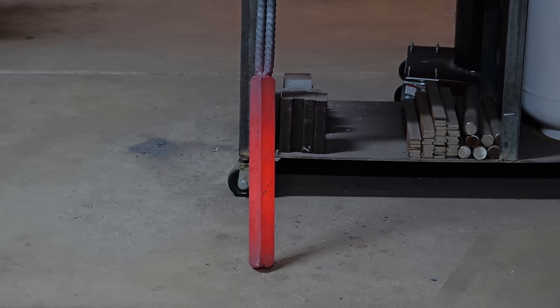Before the etch, I made sure to wash the entire blade with regular dish soap — I actually did this twice to ensure there was no oil left on the blade. My process for bringing out the Damascus pattern is the same as everybody else: I take off all the oxides with a high grit sandpaper, in my case 2500 grit, and then re-etch it — making sure to get all surfaces on the bolster as well. With everything polished up again, it's time to wash with more dish soap and then give it another two minutes in the ferric chloride. You can see a lot more contrast already, but this isn't the final finish I'm looking for. The thing about the ferric finish is that it actually rubs off — that is why I do the coffee etch later. The coffee etch leaves a dark black oxide that is actually very durable. On the second cycle, I use a 5000 grit sanding pad on top of the 2500 grit sandpaper to give the steel a little bit extra polish.